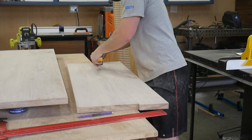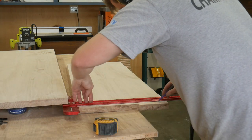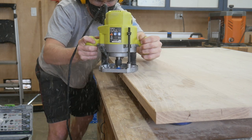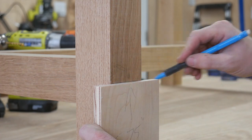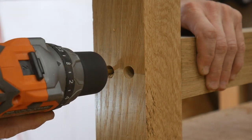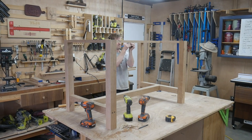That was a lot of sanding. I've taken both the benchtop and the tabletop from 80-grit on the belt sander, then 120 and 180-grit on the orbital sander, and 220-grit with some hand sanding. I also cut both to final length and added a chamfer on the top and bottom of each — it looks really nice, it's easier on your arms as you sit, and prevents bumping knees or arms while eating. Now I'm going to reinforce all the leg joints with hidden screws, plug them with dowels, sand everything starting at 120 and finishing with 220 hand sanding, and then these pieces will be ready for finish.